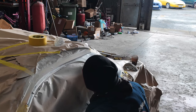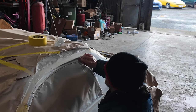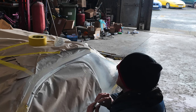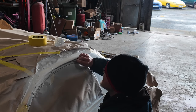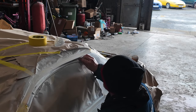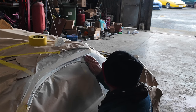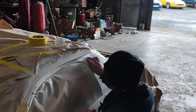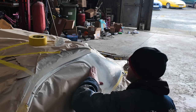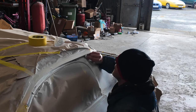The bit that I'm working on here has been a bit of a pain because the rubber that went around the edge of here, which was essentially part of the original convertible roof — I've now connected a solid roof to it and I didn't want a massively obvious join. I've never had to do this before, but blending rubber into fiberglass, I had to be really careful with. I used Tiger Seal on it to get it in there, and then I had to shape the Tiger Seal. That's not really something that you normally find yourself doing. I'm not 100% happy with it. It's about as good as I'm going to get it. It has been a tricky bit, this.